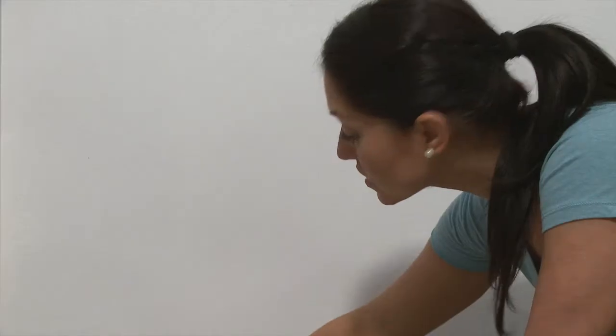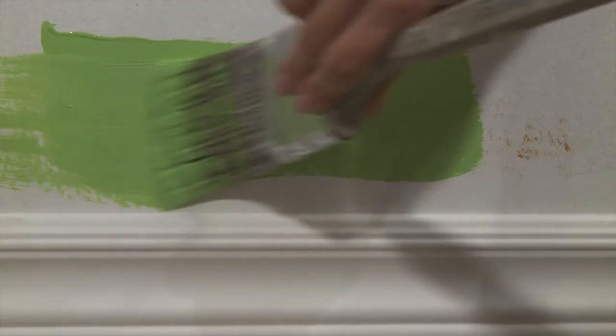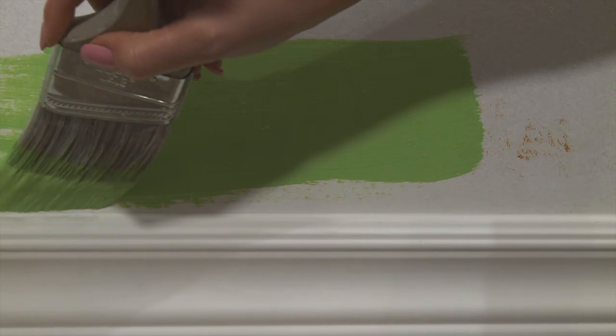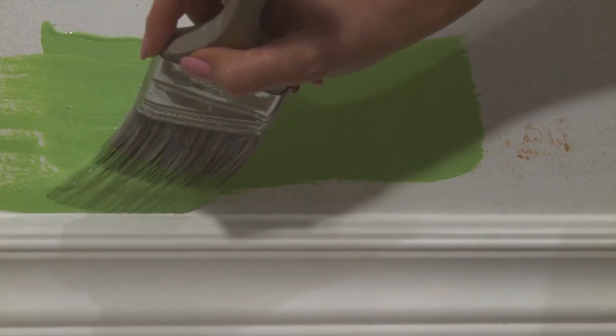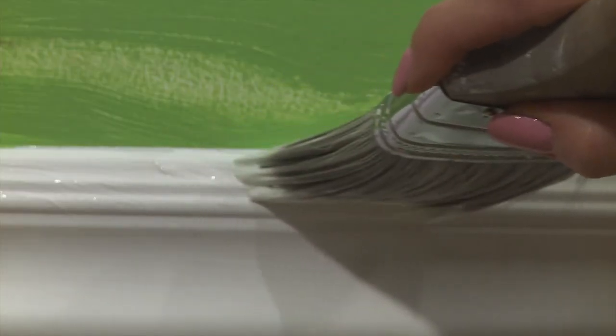Your first stroke should be about 1 or 2 inches away from the edge. The trick is to use long strokes to reduce the amount of brush marks. The second pass requires a steady hand and being relaxed. Put a little bit of pressure on the brush and run it slowly along the edge. It's not a race — just aim to make a clean, smooth line. If you do paint over the edge, the fix is to simply wait for the paint to dry and then repaint over with the desired color.